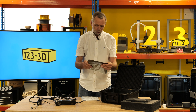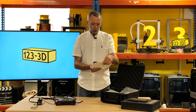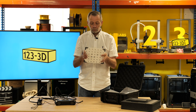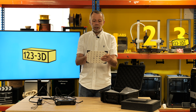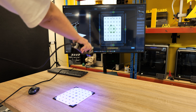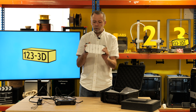We have a felt-type mat, which is for laying scanning objects on. Then there's a plate — on the back it has a QR code. You scan the QR code and it downloads the app to your computer. The other side has reflective markers and this is for calibration. When you first get the scanner, you run the calibration, following the software instructions provided. After calibration, place the board straight back into the packaging to keep it clean and undamaged, as it's always the reference point.